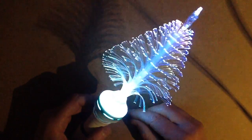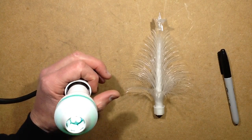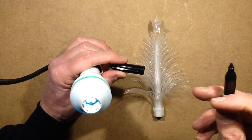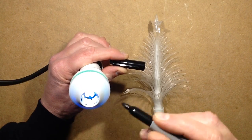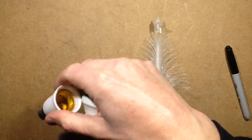So let's see if we can make this better. Here's the culprit. I'm just going to turn the soldering iron on so it's ready for us to make this modification. It's got the three LEDs. It's got that horrible flashing one — I'm just going to put a black dot with a Sharpie on the end of the flashing one because I want to mark it so I can remove it, because it's hideous. Then we shall take out the lamp holder — in fact, I'll just remove that lamp holder out of the way completely.